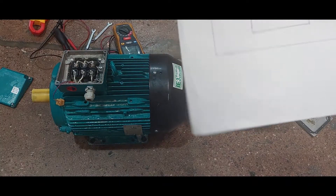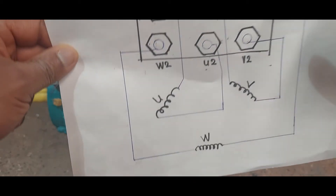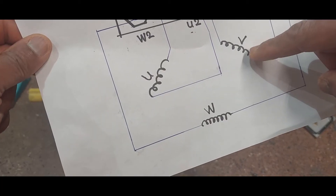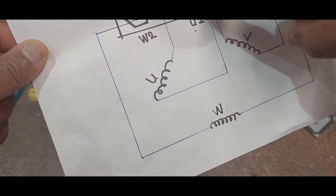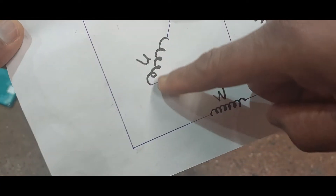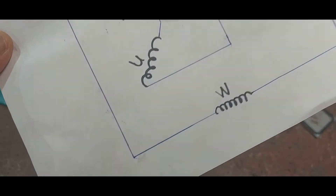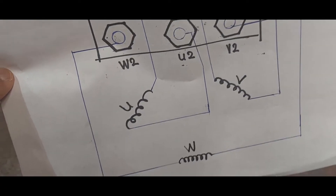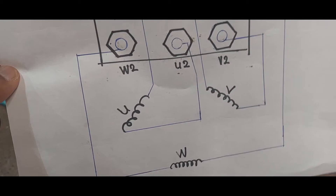U1 and U2 are as drawn here. Each of these coils represents a group of coils, so here is U1 which is linked to U2. When we do the continuity test, we want to know that there is no breakage — that it continues — and then we are going to read the resistance. If the resistance is very, very high, then that means there is a problem.